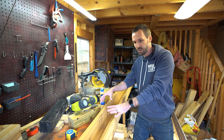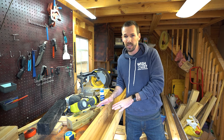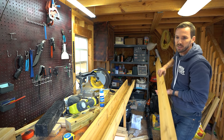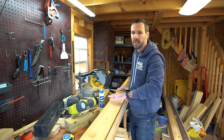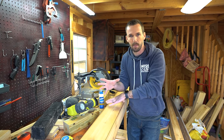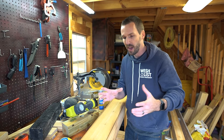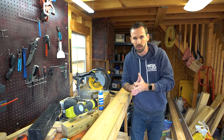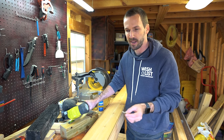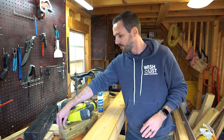Anyway, what I'm doing here is, I have the three sides cased, which is all you need to wrap around the post. But since I am going to be transporting this over to that house an hour away, I am going to put the fourth board here and temporarily tack it on with shorter nails. That way this all is squared up by the time I get over there. And who knows how many days it's gonna be until I get there. So with the weather and all that, I just want this to be all squared up. So I'm going to tack it on with a few 1-inch nails just to barely grab it on. And then I'll pop this board off when we get to the house so I can case around the post, which you'll see.